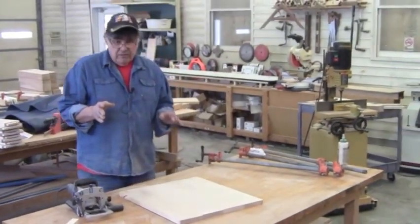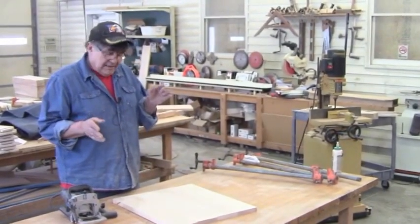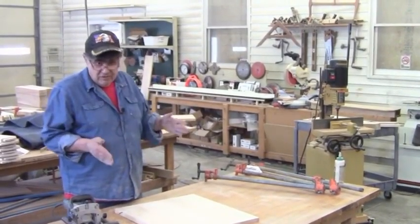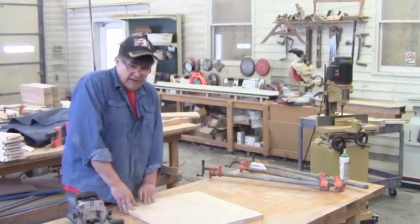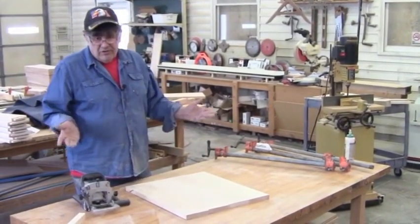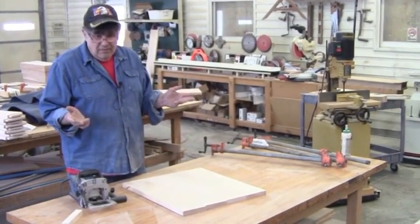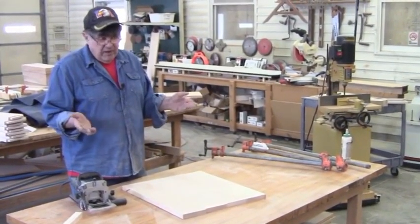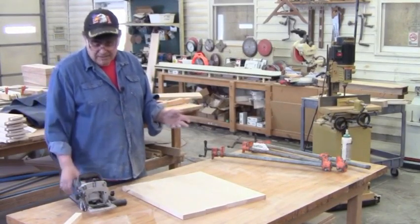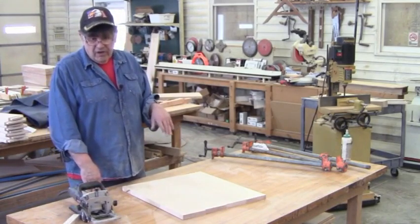Now the other thing I do, I never glue to size. I see guys who need a panel 22 inches long, they cut everything to 22 and they're fighting and wiggling, trying to get that end just perfect. Nah. At the table saw, you saw the crosscut sled. We size it after it's glued up. Particularly if we've got a drum sander, once we glue it up and level everything, that's the time to cut it to size. Not now. It's just too much room for error.